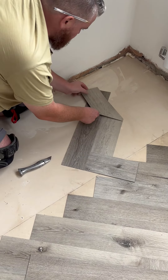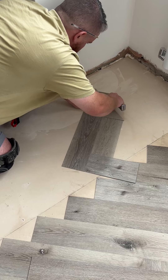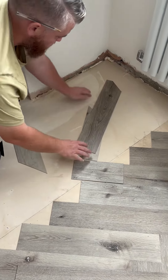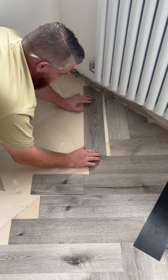There's a much easier way to stop your planks from moving — just use some tape, whatever you've got that's handy. As you can see, just setting up there. Simple: score the top of the LVT, then a little snap and it should fall into place — one, two, and three.